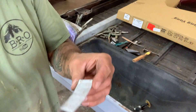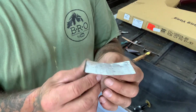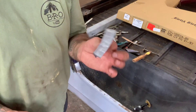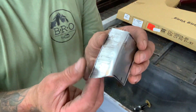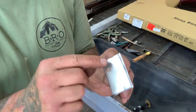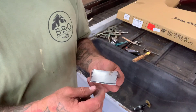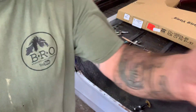I took a piece of 20 gauge sheet metal and broke it on the end of the table for a 90-degree bend, then put it in the stretcher and stretched one side — you can see the shape that gave it. I test-fit that piece in there to see if it was going to work, and it did. This was just a piece of scrap. So I have this piece already made to shape, trimmed the edges so it fits in there nice.